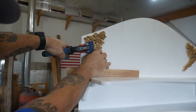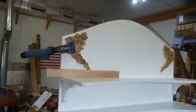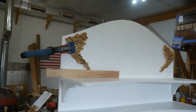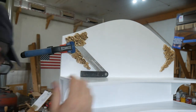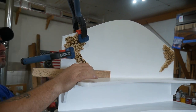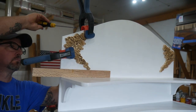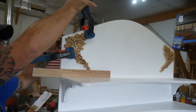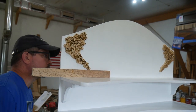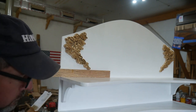Let's put these things on the shelf itself. I used a piece of oak as a spacer so both were at the same height. I then measured off that point on each side to ensure they were both inset the same distance. I used a bevel gauge to confirm the angle was correct on both sides. The first one was screwed in place, so I had to match it on the second one, drilling carefully from the back so I don't come through the front. Three-quarter inch pan head screws to secure it in place.